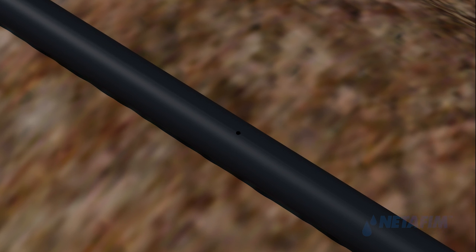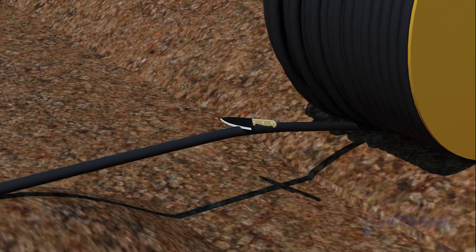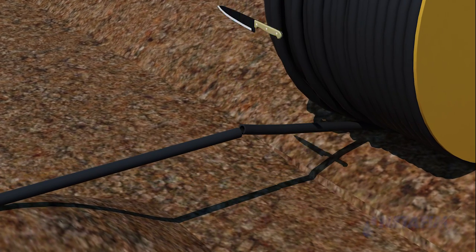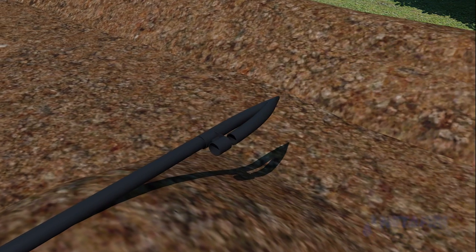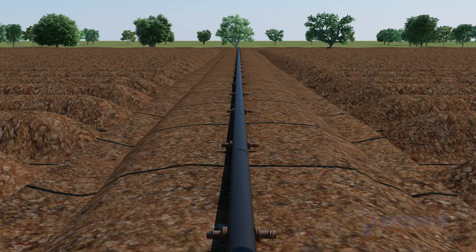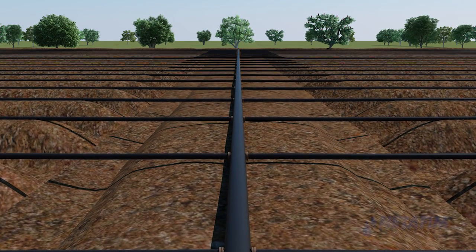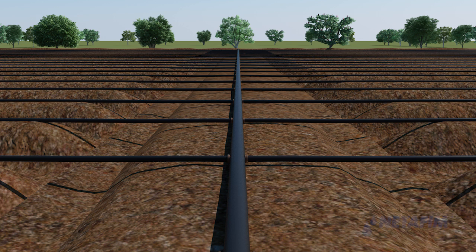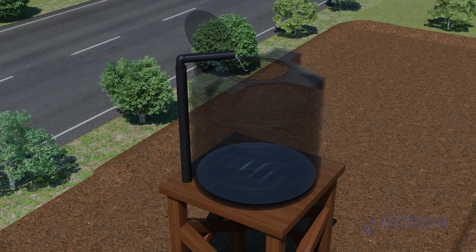When the end of the field is reached, cut the dripper line from the coil. Take the dripper line end cap and seal the ends as shown. Install the dripper lines onto the other male connectors along the length of the field in the same manner.